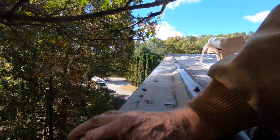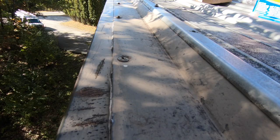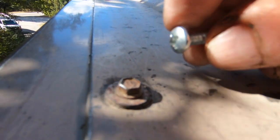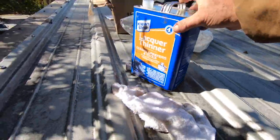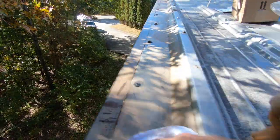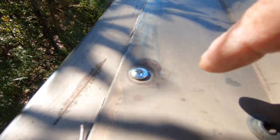I've identified the problem. Now I'm going to seal this joint — not with caulking, I don't believe in caulking. But first I have to replace these hex screws that hold the panels down with flat head screws to get a lower profile. Before I can do that, I'm using lacquer thinners to clean the surface so I can get a good bond when I do the seal. I clean it with lacquer thinners, then replace the hex bolts with flat heads all along there for a lower profile.